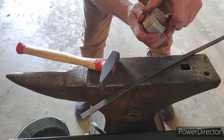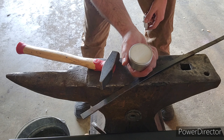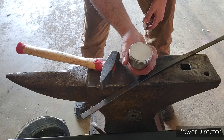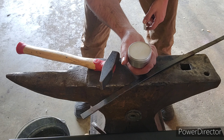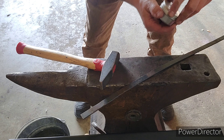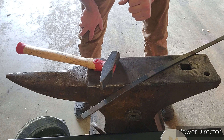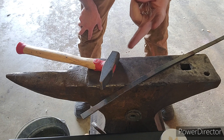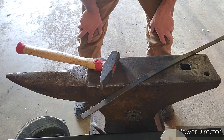Once you remove all that scale, oxidation, and mill scale, you put a welding flux down onto it. Welding flux is typically borax. This is about the cheapest borax you can get — 20 Mule Team. It's somewhat soapy, but it's cheap and it's what I have. The borax does two things: it cleans off the area to be forge welded while it's hot, and it prevents any further oxidation of the surfaces you're welding together.